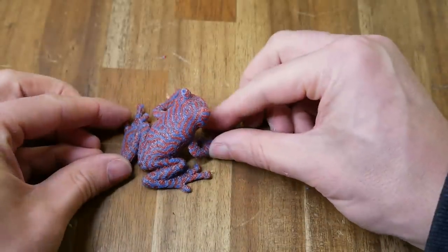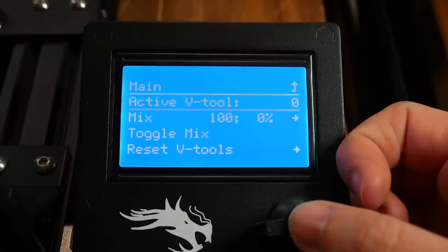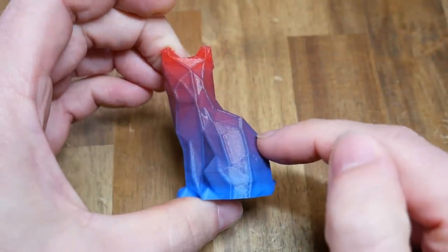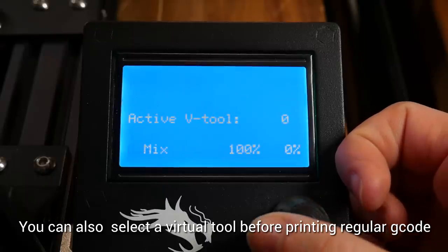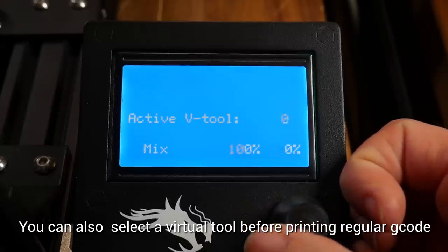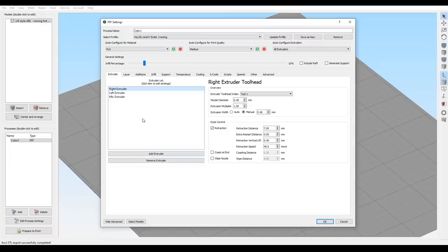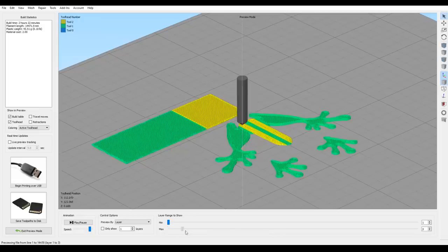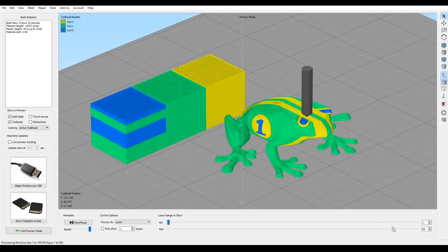This is a particularly good model for testing out dual extrusion, and it proved for me that this system works as advertised. There is of course the matter of the purge block, coming in at almost twice the weight of the actual object. One other feature that you may have spied earlier is virtual tools. Let's say that we inspect our gradient fox and particularly like the shade of purple 40% of the way up — that means 60% of the way down from the top. In the LCD menu, we can now create a new virtual tool and toggle the mix to match those values. On the LCD, we can actually set up a range of these virtual tools and store them to EEPROM. In your slicer, you can then add another extruder — in this case it's called Mix Extruder — and simply set it to the correct tool to match what was on the LCD. By making virtual extruders mixing the two colours, it's possible to have multi-colour prints using only two rolls of filament.